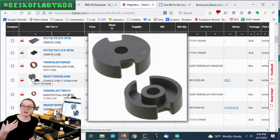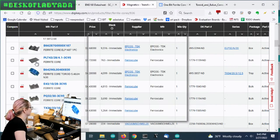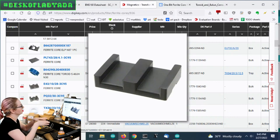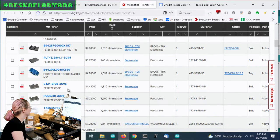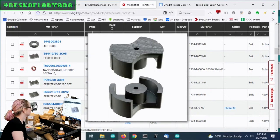Having a magnetic core around a wire, like a USB cable with a big lump in it, reduces the amount of electromagnetic interference. So they're used for a couple of things, and all sorts of shielding. I don't know what this E-shape is for, maybe ribbon wire. Actually kind of neat. We have the Apple II disk drive, which has a gigantic chunk of ferrite core material on the cable as well, because it was non-differential, so lots of EMI.